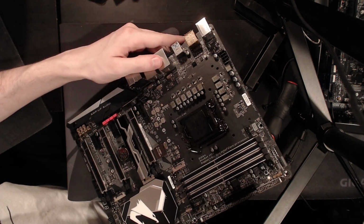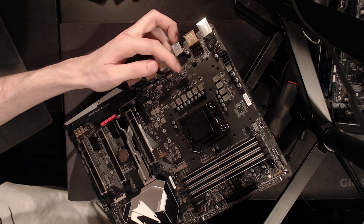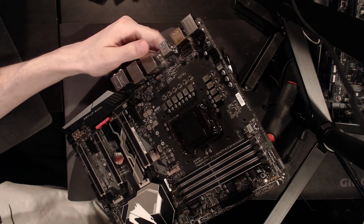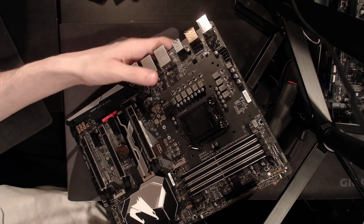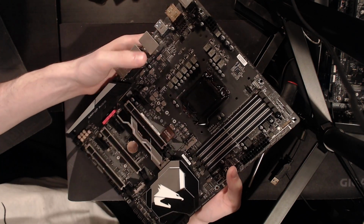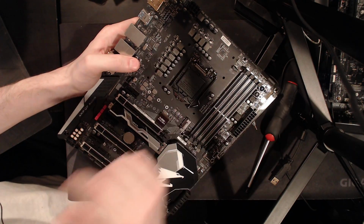And basically, it means that with this VRM, you don't have to ever worry about, like, an 8700K; it should have no chance of overloading this VRM. Even on liquid nitrogen, this VRM should be perfectly good. So, yeah, I'm happy that I have at least this board, though I still don't have an 8700K to put in it, so that's not going anywhere. That's the V-core and the iGPU. The iGPU is using the same power stages.